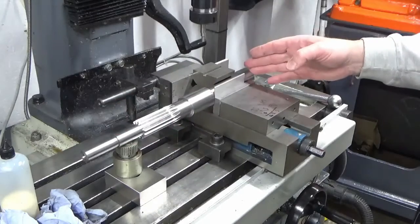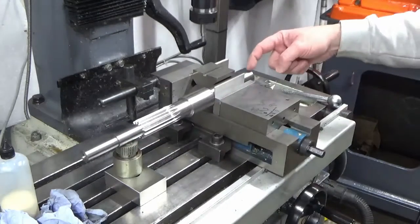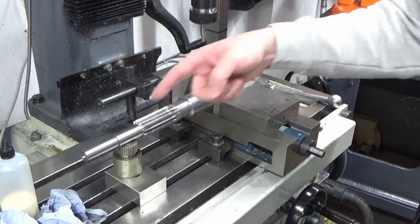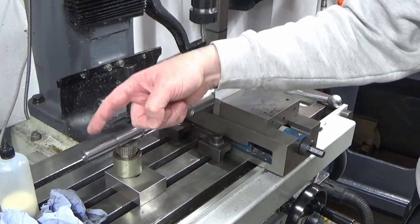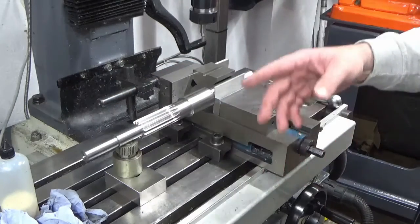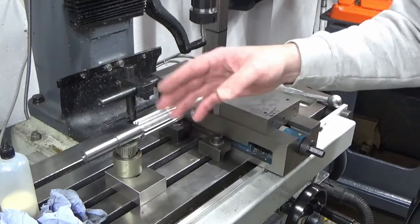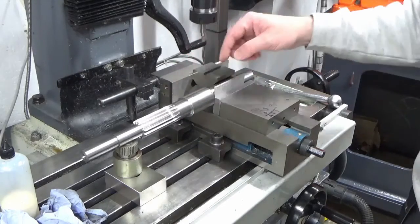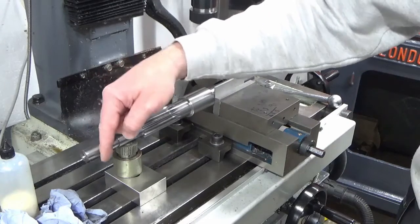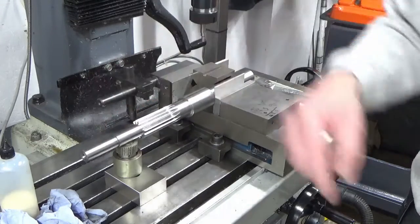We've set it up deliberately this way on the mill, so we've got a keyway to mill in this end, and then I've got enough x-axis to get right down to the other end, and we've got a hole to drill and tap through here. So two separate operations, largely two separate setups. So even though I've clocked my vice in, because of all of this paraphernalia going on in here, I will reset up my shaft centre line when I get down to this end.